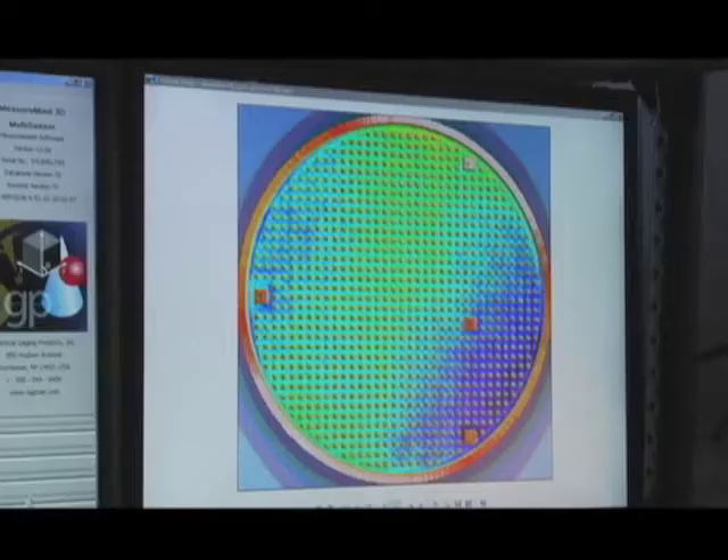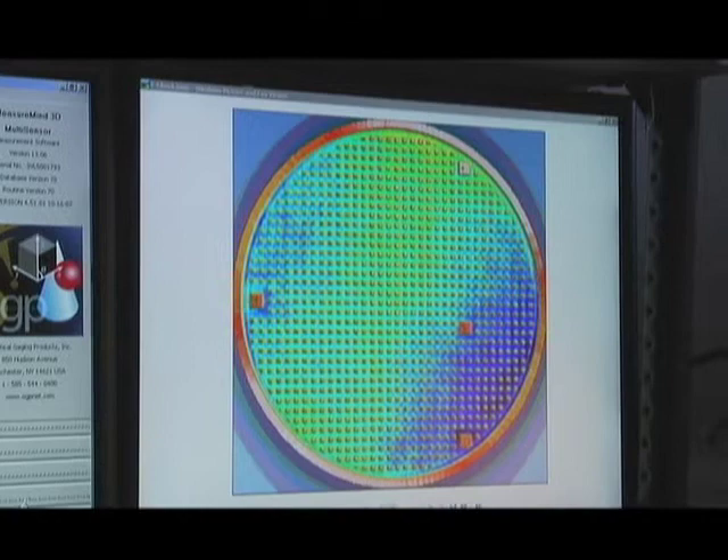These chucks hold wafers during their processing. We can see the surface has very small raised pads. The top surface of the raised pads defines a surface where the chuck will be pulled against. The concave or void area next to the pads is generally called the field. The parallelism of the plane establishes how flat the wafer will be held, and the coplanarity between the top of the pads — called mesas — and the field below affects how well the wafer will be held in place.